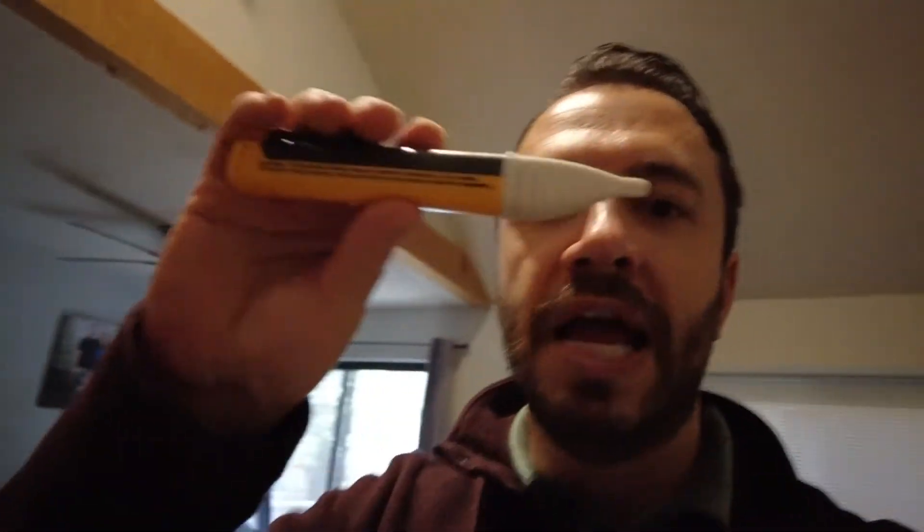Just to confirm that it is working, I will cut the power. I pre-apologize because it will be a little bit dark, but you'll still be able to see that the light isn't going to be solid red. Back to the same switch — I'm holding it up against the switch just like before. No solid red light, so the voltage is actually off. I did cut power to the switch, so I could now safely work on this.